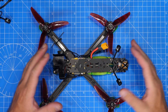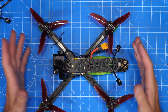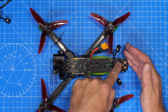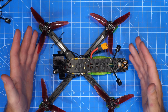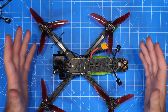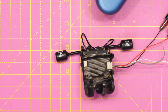Before we do what we're going to do today, I've done some other testing. I can actually get the GPS to sort of behave if I power my flight controller first, allow the GPS to get satellite lock, and then power the aircraft up via the battery. However, as soon as I do power up by the battery I actually start to lose sats and get problems in flight — it's still not working correctly. Now I want to demonstrate to you what the actual issue is that's causing the GPS problems.